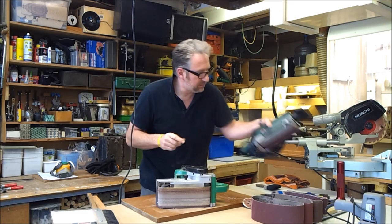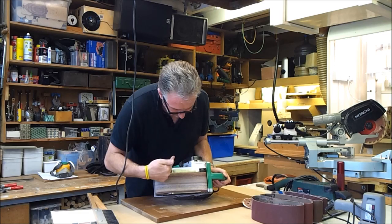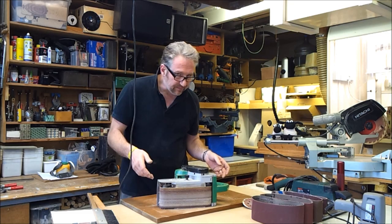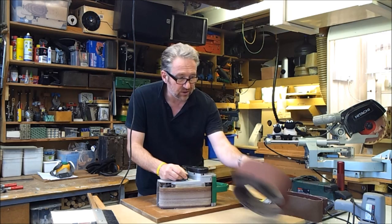The other thing you have to be very aware of with belt sanders is that they have an adjuster. On this particular smaller model, the adjuster is here — it's literally just a screw-in, screw-out adjuster. What that adjuster does — it's very delicate — it's very easy when you've got it on to see the belt fly either in this direction or in that direction. By little adjustments it'll ride up or down; indeed it will fly off completely if you're not careful. You just have to play with that for a minute until you get it right before you can use it, especially when you've changed a belt.